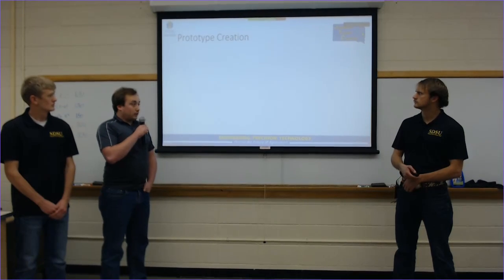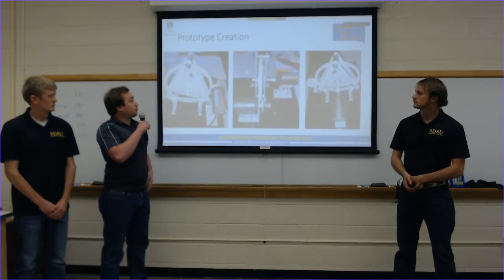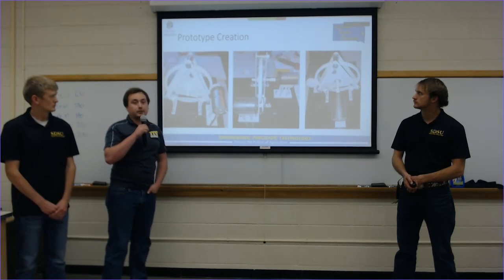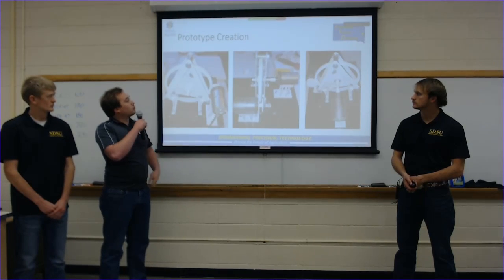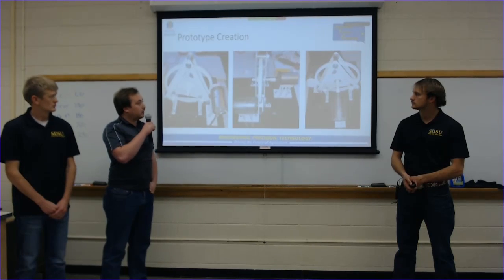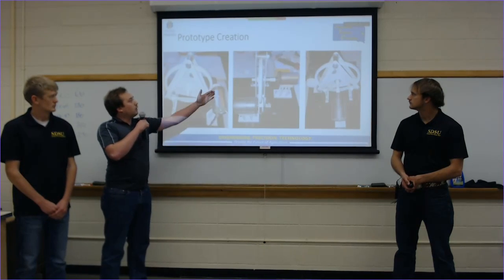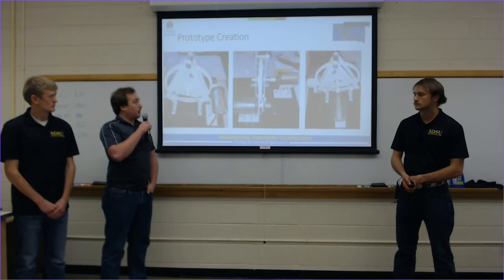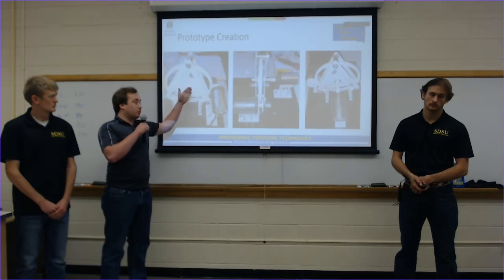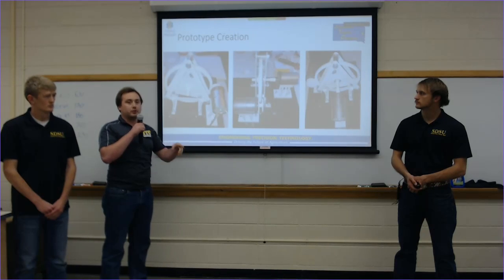Earlier on I also made a 3D-printed prototype to validate this concept. I had two electric motors run the whole thing — one for the external ring gear and one for the main sun gear — and it did come out as planned. We did get the ratio we wanted. The input electric motor ran at about 100 RPM and dropped the output down to 30 RPM. But when we ran the second electric motor we could bring it back to a 1:1 ratio.